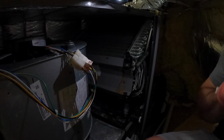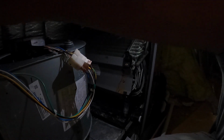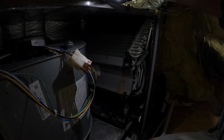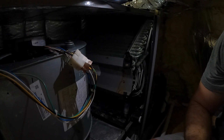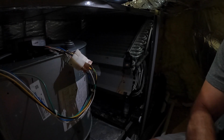This is a, let me find my panel here. Yeah, this is a 4 ton, and you use at least 2 tablets for each 1.5 tons, and then 1 tablet for maintenance. We always do go to the far end of that, so we're going to use 8.